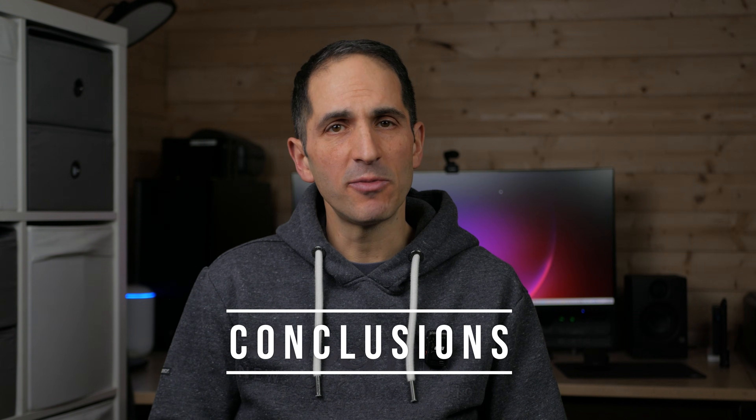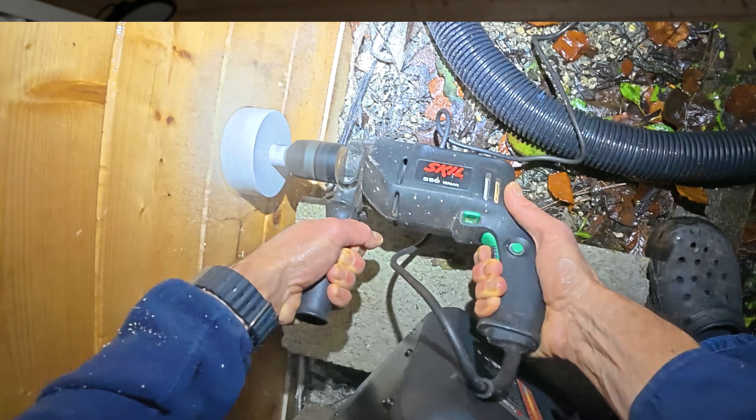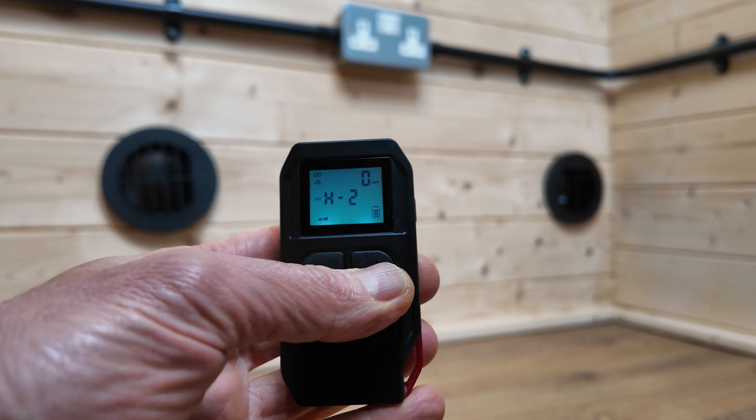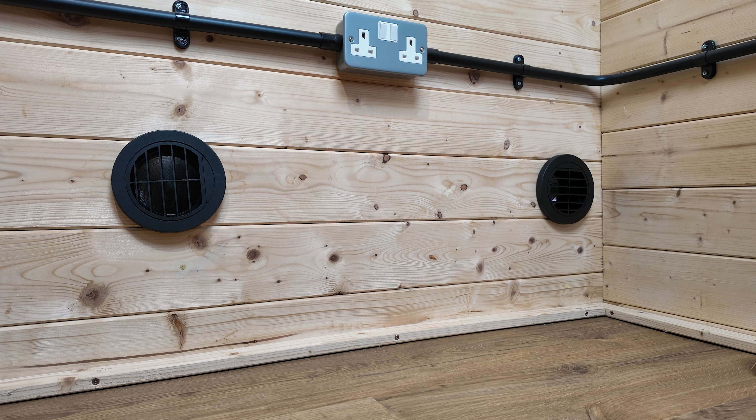I'm still not super keen about burning diesel, but for my cold garden office these heaters have been quite a revelation. They're cheaper to run and make it far easier to get and maintain the right temperature compared to an electric heater. They're fairly straightforward to set up, not too expensive to buy and should be mostly maintenance-free if used correctly. Installing them outside is safer, a little quieter and avoids routing a very hot exhaust pipe through your wall. While there's no noticeable smell in normal use, refilling them almost always leads to a drip of diesel which you definitely don't want indoors. It's also worth noting that even outside, the rush of air at higher output levels is still quite noisy — I have to turn mine off completely while filming.